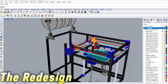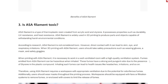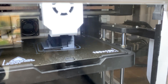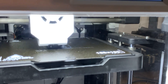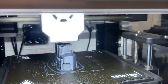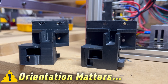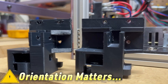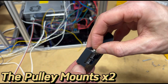Like, releasing toxic fumes stinks. But how bad could it be? Is it really deadly? I mean, I printed so much ASA filament. The least I should have gotten was a headache or skin irritation or something based on these internet articles. Once the parts actually stuck to the bed, I had to use some magic 3D printing adhesive. My printers were producing parts in no time. Orientation matters for ASA printing, and not in that weird pronoun-using way. I actually had to redesign the parts so that a larger, flatter surface was used as the first layer, which gave the part much better quality overall. After all the ASA printing was done, all that toxic filament fume filled up my house like a giant meth lab.